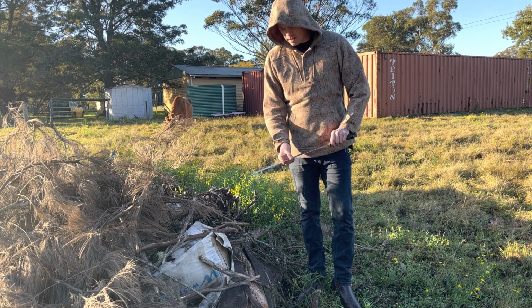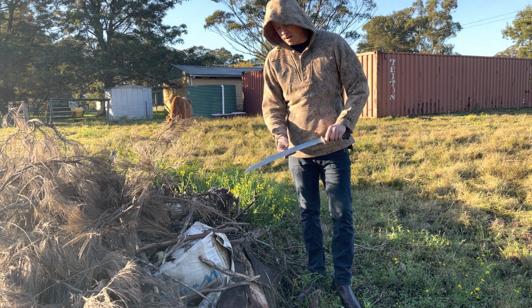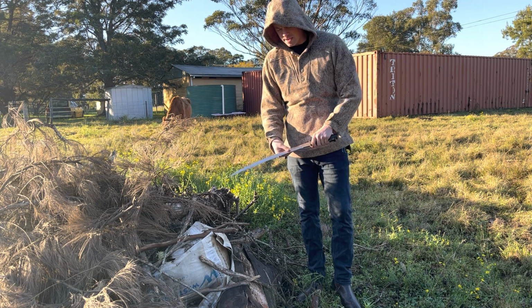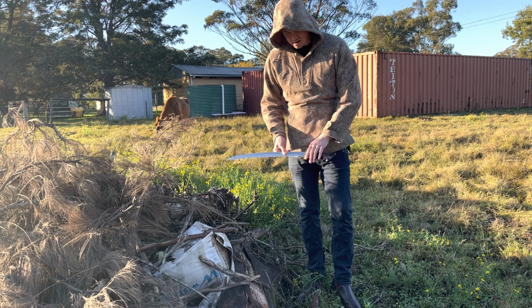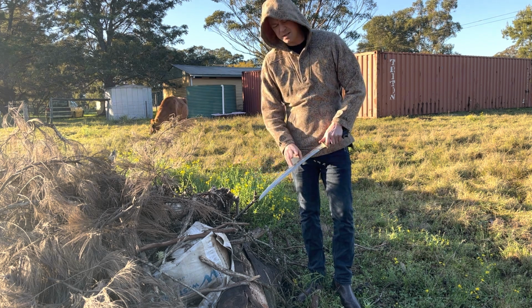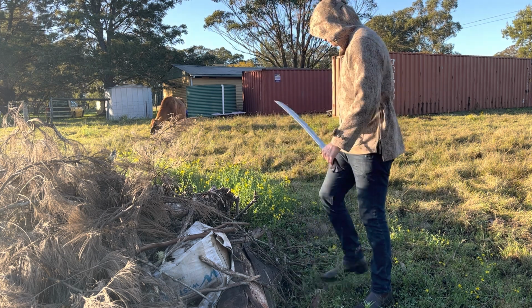My intent is that if I design one, I'm going to design multiple versions of this. For those of you that would rather a modern martial arts weapon, I'll keep the blade geometry and everything exactly like this, same quench, same everything, just with my modern styling to it. Maybe a reinforcement of the tang, because this tang only comes back to here and has a pin in it. I'd go all the way through. For my utility version, you're talking sort of spring tempering. This one's 1095. I don't know if I'd be using 1095 for the utility version. Might use 5160 or 80CrV2, something like that.